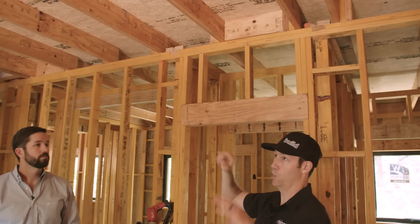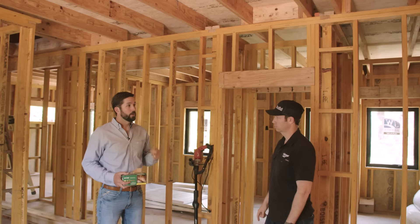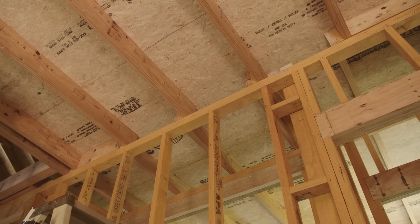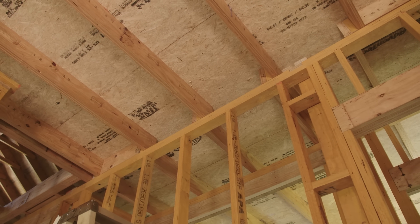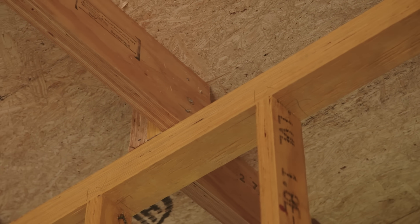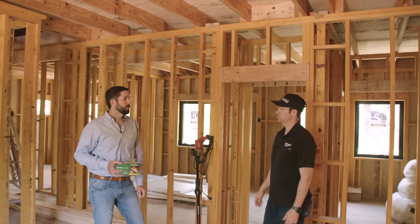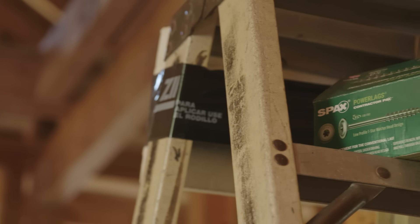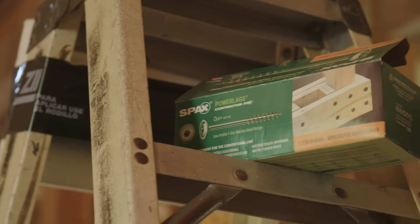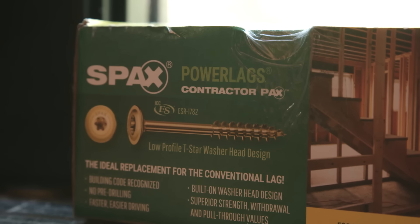Alright, we're on the second floor now - we were just standing above on top of that decking. These ceiling joists are the bottom cord of our truss. As those rafters get loaded and try to separate, they put a horizontal force on the top of the wall, and the ceiling joists resist that horizontal force - so the joists have a tension load. Where we splice the joist, we need a connection properly designed to transfer that load - it's a tension load in the member but a shear load in the splice.